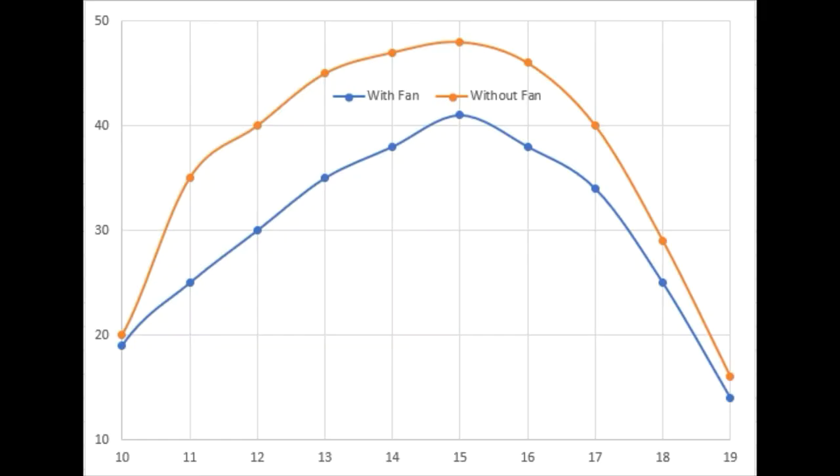I did run a little experiment to test out the fan. Now while no two days are exactly the same with cloud cover and temperature, I tried to find two days that were pretty similar in forecast. These numbers on the left represent the temperature difference between the attic and the outside temperature. The values at the bottom are one for every hour between 10 o'clock and 7pm. The fan did keep the attic a bit cooler, and I'm hoping this eventually leads to some energy savings and prolongs the life of my air conditioner. Since the hottest days of summer have already passed, I'm anxious to run this test again next summer when it gets back into the hundreds.